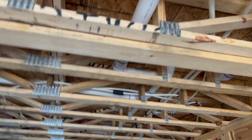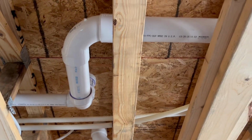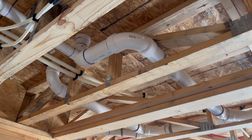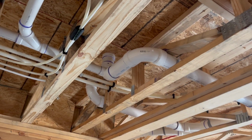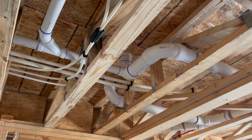We'll walk that out first. We've got a 3-inch sweep right there that comes over and goes into a 3-inch side outlet that goes underneath of that toilet. A lot of places I've heard you can't use those. I can definitely use that here. Again, everything you're seeing right now is going to pass an inspection. If something happens that it doesn't, I'll let you know, but I do it like this all the time where I'm at.